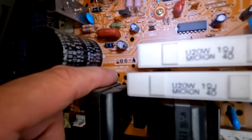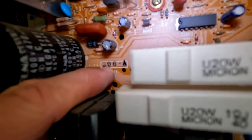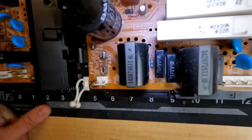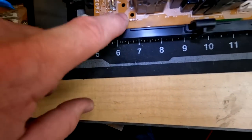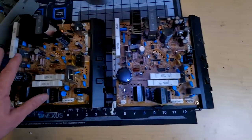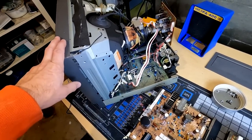This is a 651-95713, and 651-95712, and they're both 147Bs, although that's been stamped over to say 206A, 107B, 147. I don't think there's really, I don't know, there might be a difference here. It's not a lot. There are definitely more components on this American version. And just to be safe, I'm going to use this American version because it's going to put out the same power that this board would. So let's install this one, and then we'll run a test and see if this monitor works.